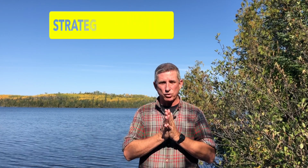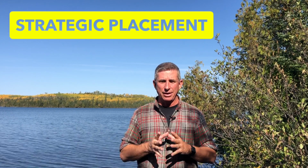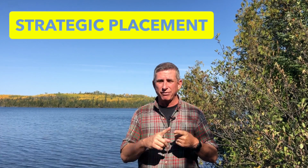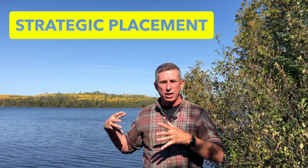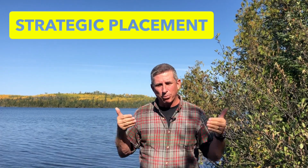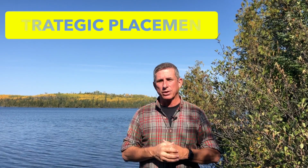These guys are really, really important. They're concepts first, parts second, okay? So first of all, a strategic place, a good location where you can put that basin and eventually that sump pump. It has to be in a place where you can get power to it reasonably easy, and it also has to be a place where all the other drainage lines can conveniently converge to it. And then you bring those drainage lines into that basin, and then that discharge line goes out. So strategic placement, number one.